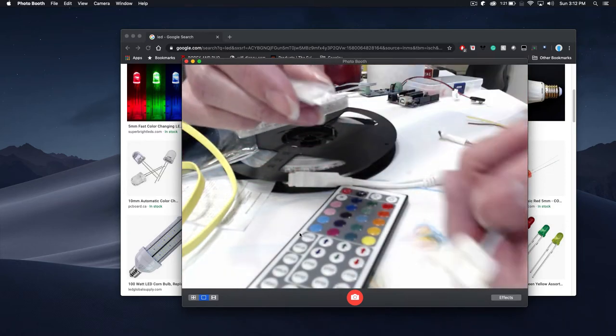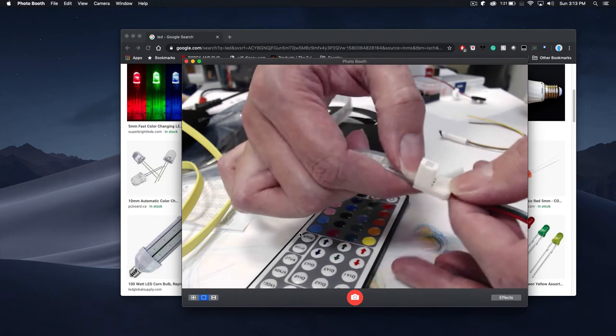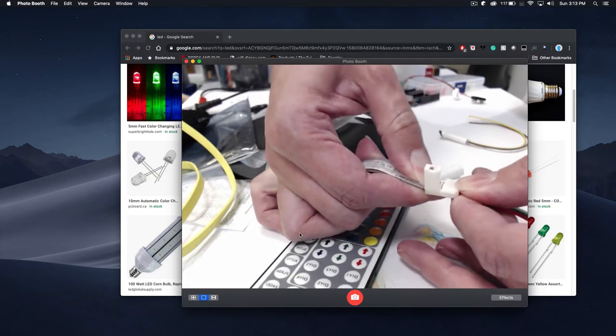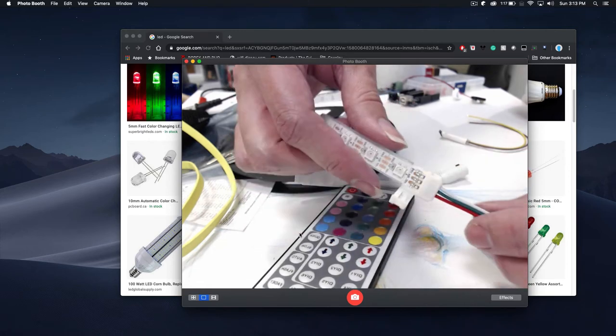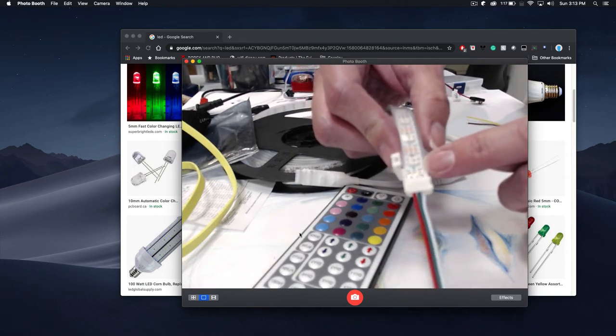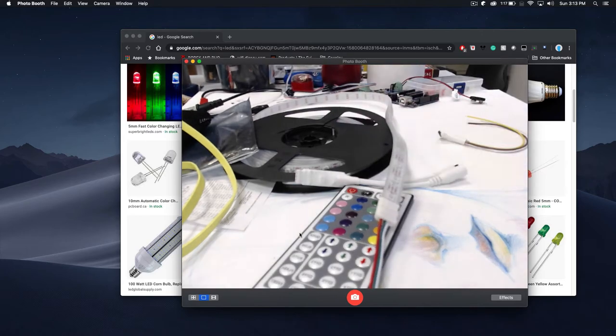You want to pull a little bit of the casing out or cut it away — it's just plastic so you can cut it. Then all you do is simply slip the LED strip into the connector and go underneath these little prongs. These have little metal tips that touch the copper pads. When you close it, it puts some pressure on it, which allows it to stay put. These are good for a lot of different stuff, but just know that they are not permanent — if you jostle it around a lot on your costume, it has the option of falling out.